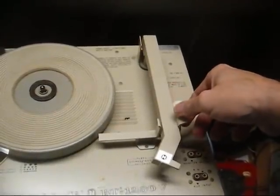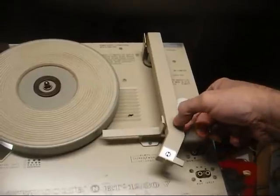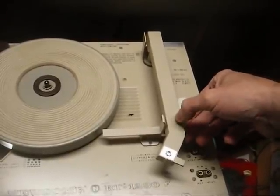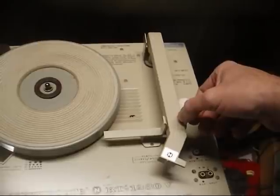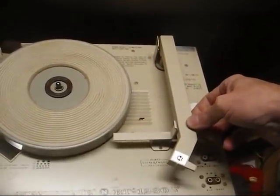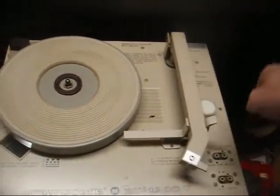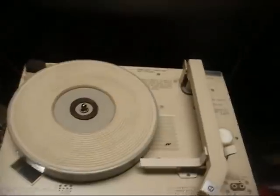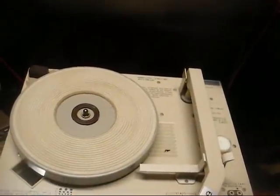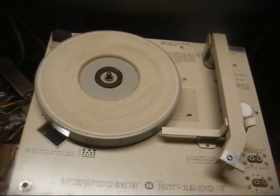Most of the ones I find with a plastic clip are broken from old age and plastic getting brittle and people pulling the retainer clip back too far to release the tone arm. You just have to move it back just enough to release the arm. You don't have to go yanking on it. But still, they should have stuck with the old-style metal tone arm lock.